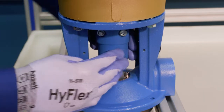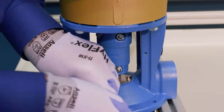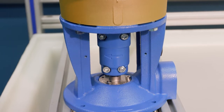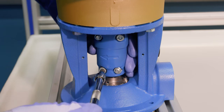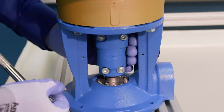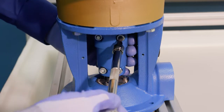With the coupling guard off front and back, we've exposed the pump shaft coupling. We need to remove the coupling bolts — two on the bottom and two on the top. We'll reach in with an Allen wrench to loosen them. If they're tight, use a ratchet to break them loose, then remove by hand. There's one on the bottom facing forward and one on the top at the opposite corner; break those loose, spin the coupling around, and repeat on the opposite side.